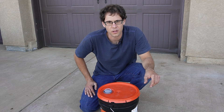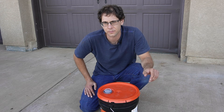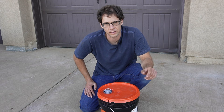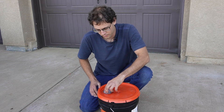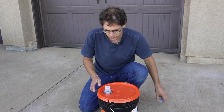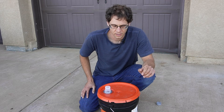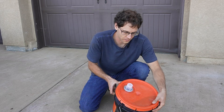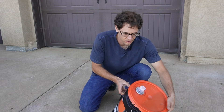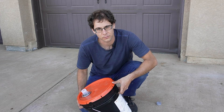We're just about ready to put hydraulic fluid back into the tractor. We're going to be pouring from five-gallon buckets, which admittedly is a bit of a pain. Fortunately, these buckets have spouts integrated into the lid — the spout pulls out, the cap screws off, and you can pour directly from there. One tip for pouring from a full five-gallon bucket is to pour away from the spout. That way the bucket has to be at a very high angle before anything comes out. If you tip it towards the spout, fluid's going to come out very quickly and it's going to be really easy to spill.